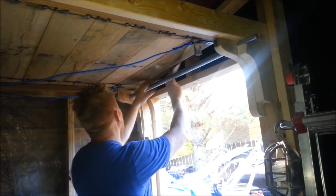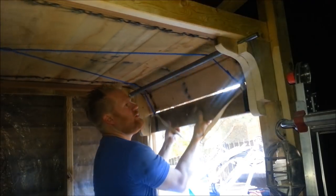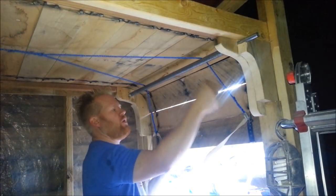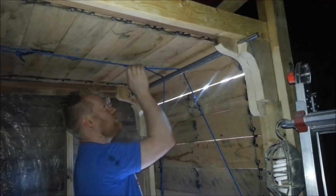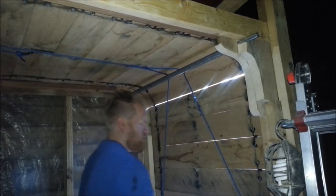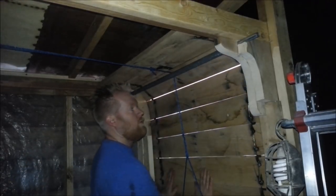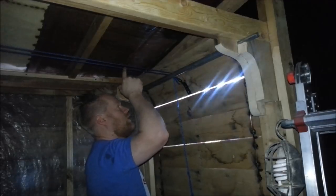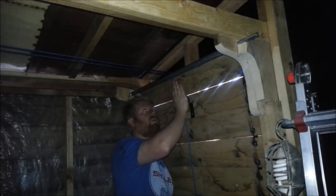This is actually a pulley as well — it's a pipe in a pipe. As the door starts to shut, this deflects the rope pulling down there so it acts like a pulley and it rotates along the whole length of it. Same with the upper one — they both deflect around that, so it keeps the rope out of the way when the door is open.